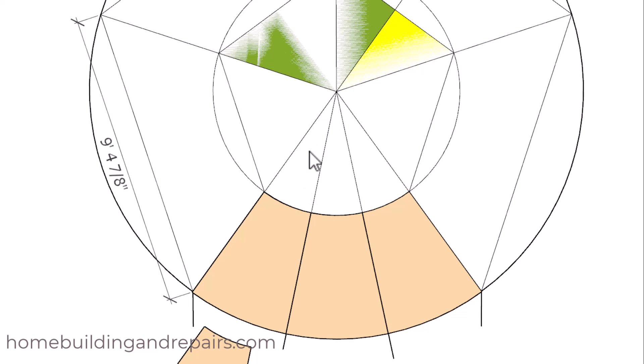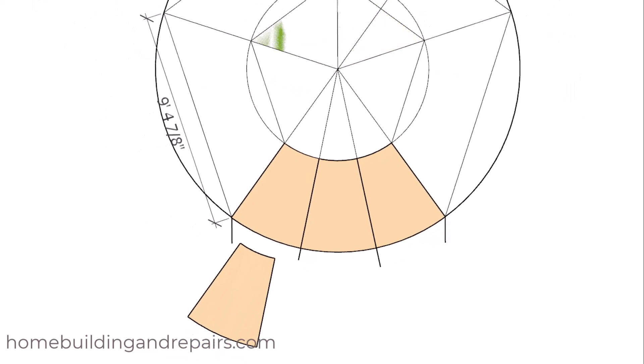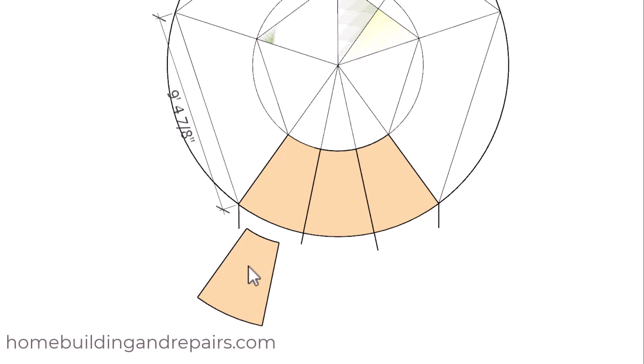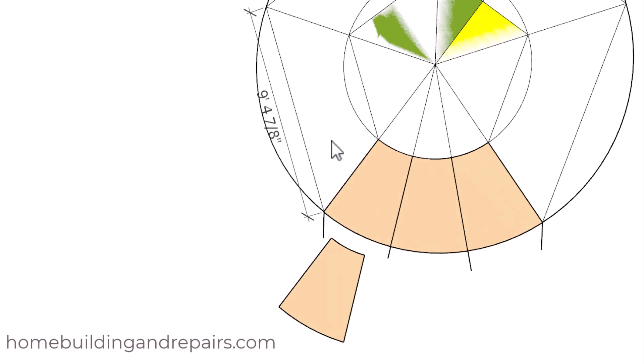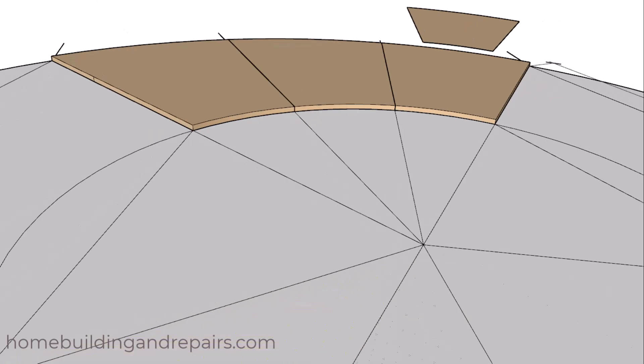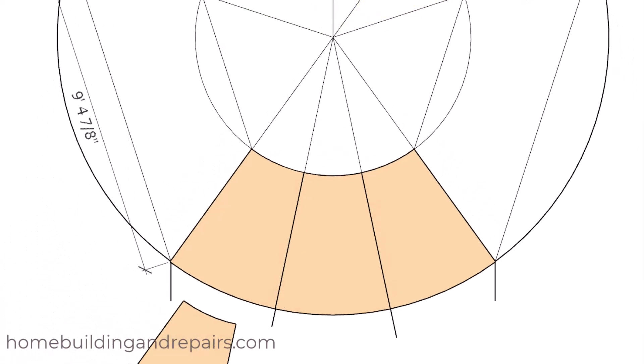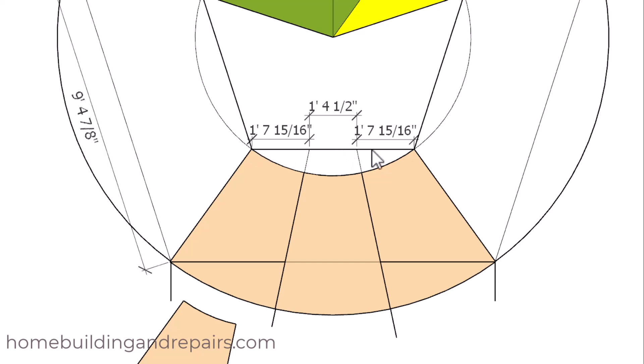In the center we have one foot four and a half inches, and then we go back to the same measurement as the first step. Looking at the exact 24-degree sections for a circular step, all of the measurements should verify that each step is exactly the same. This is where a lot of people get messed up — they think they can divide everything into equal degrees, but that won't always work for straight lines.